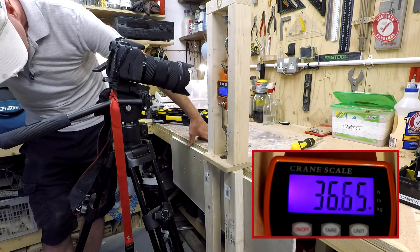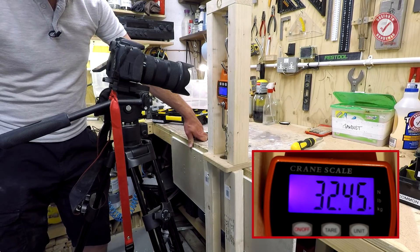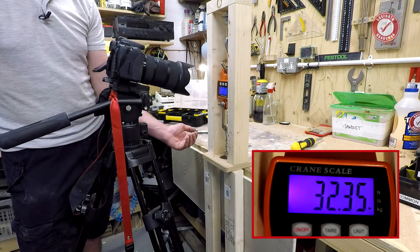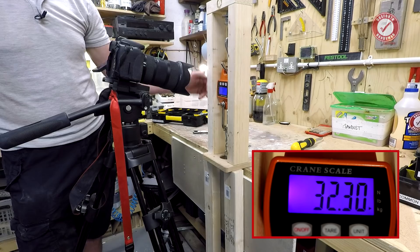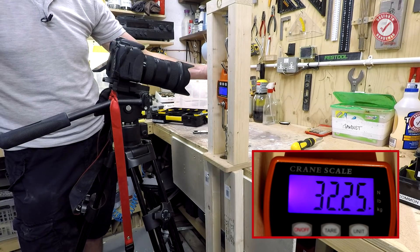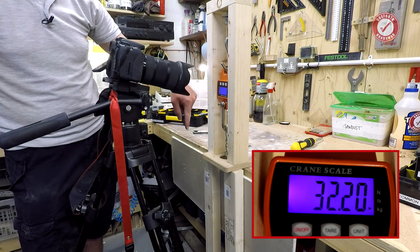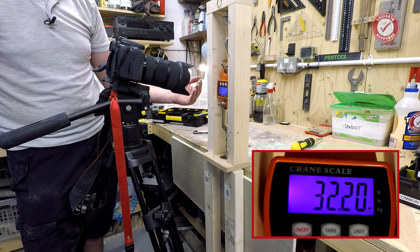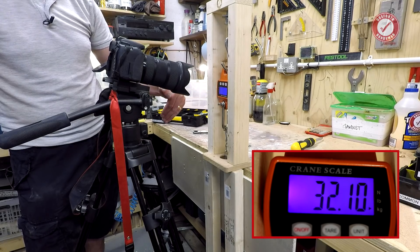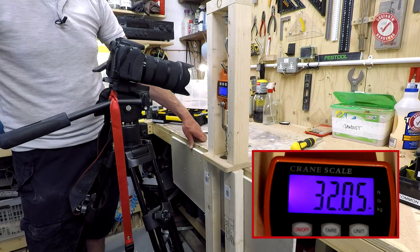We definitely went past 40 there — just trying to pull out at a bit of an angle. We're sitting just past the 32 kilo mark, which isn't bad for one lightweight plasterboard fitting. It's just to show you the difference between shear force and axial force, and why when stuff is hung on a wall you can get away with much higher loads than a force that's trying to be pulled directly out from the wall. For pictures and flat objects, nearly all the force will be shear. For TV brackets and shelves, there'll be a much higher axial load. My general rule of thumb is to always treat it as an axial load and then anything else is a bonus.